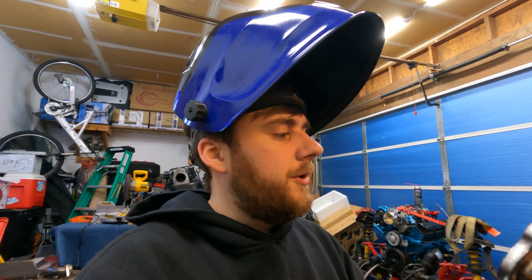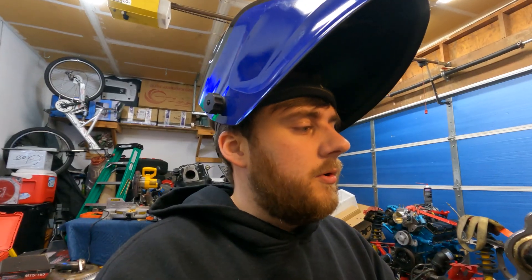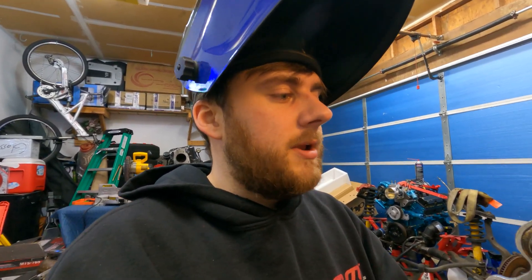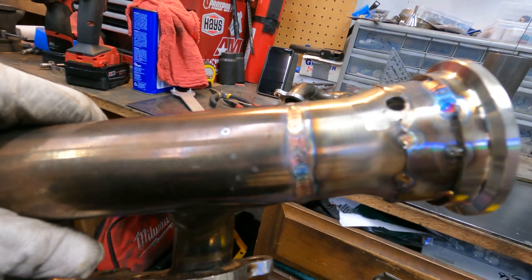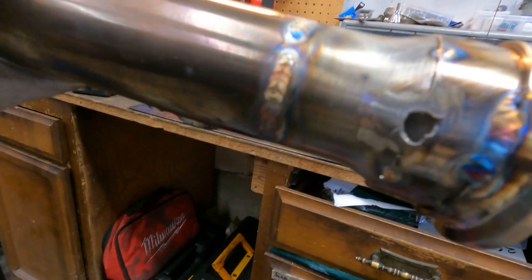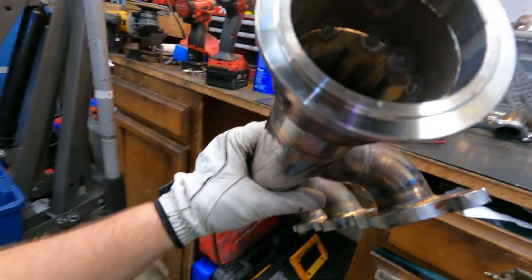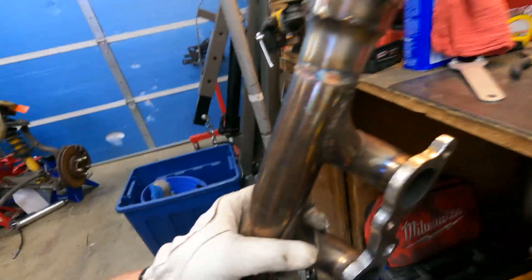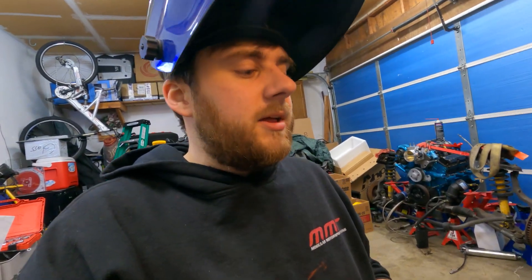Alright guys, did some welding — I had to cut for a second. I did blow a hole in one but that was just entirely because I was at a bad angle, but I filled it up. As you can see that looks really good. It got some actual color in it which is pretty neat. All of it's really nice. We'll have to clean that up. I didn't get the back purge set up — there's a lot of ports on this thing, and it does take up a lot of gas.